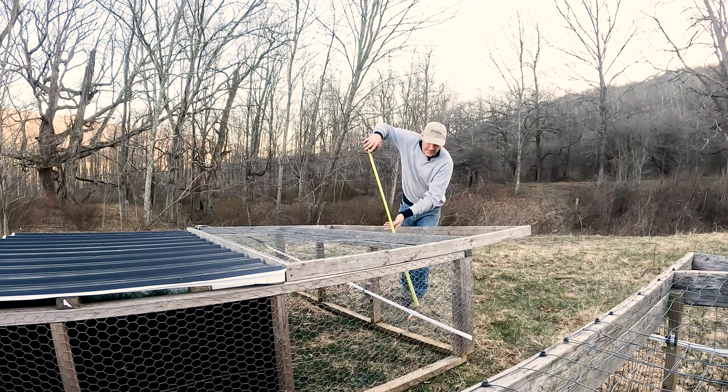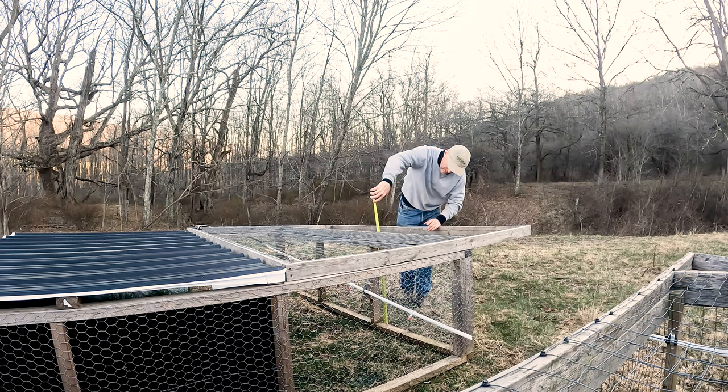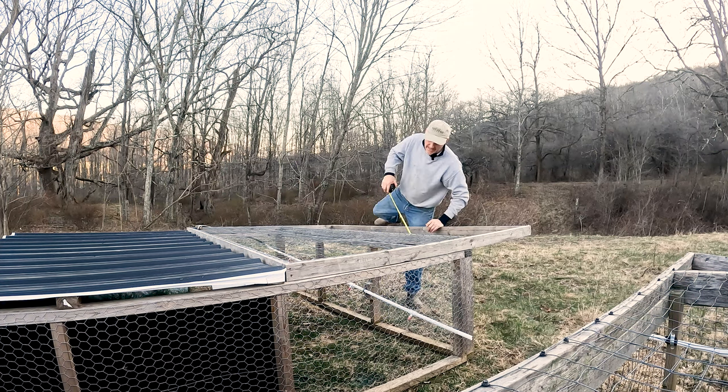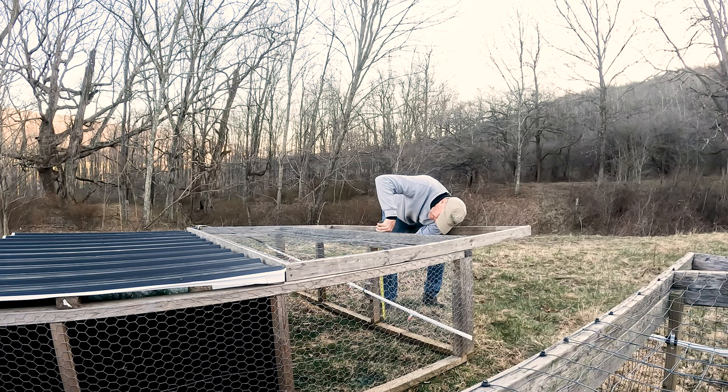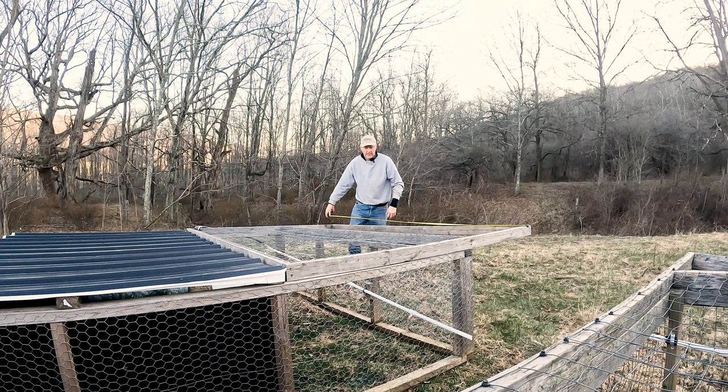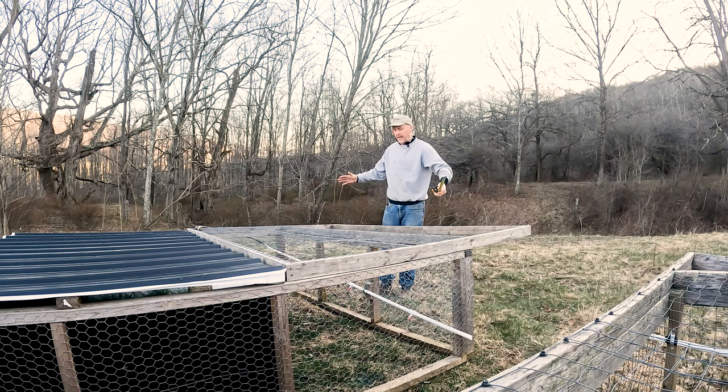To give you an understanding of how tall this is: from the base to the top of the panel is right at 25 inches. So your inside dimension of the upright on this particular model is 22 inches. You've got four uprights on the front — one on each end plus two — and the sides are made the same way. The overall width is eight feet, and I made my front panel a full eight foot so I didn't have to cut anything. These pieces have to be cut down to 93 inches so they'll rest on the top plates.